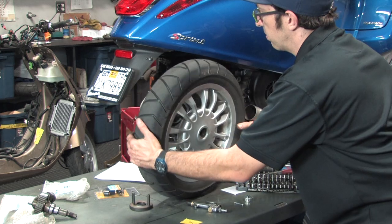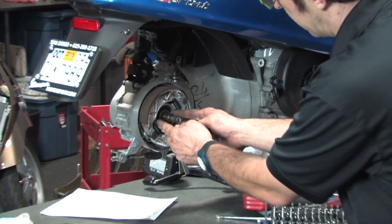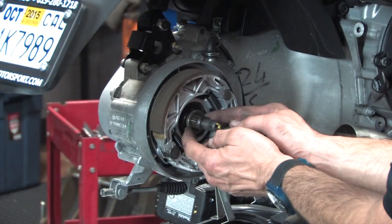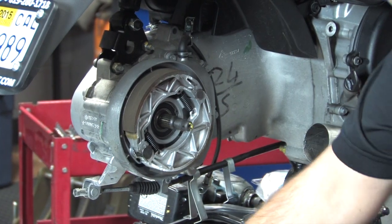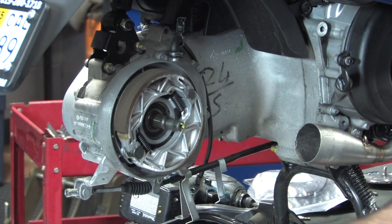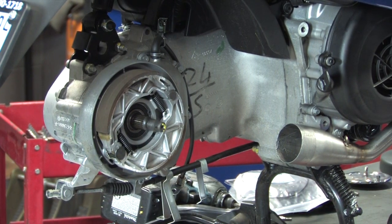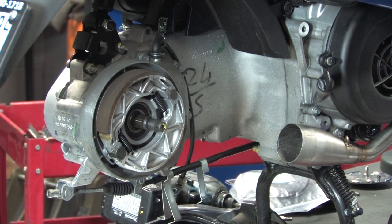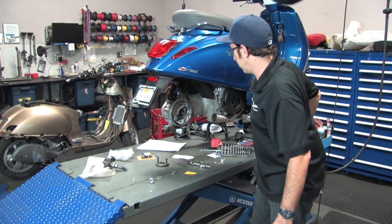There's your washer, wheel comes off. We've got another washer in here — a thick washer. Inside the hub is the thick washer; outside the hub is the larger diameter pin washer. We're going to have to disconnect the brakes and get the brakes out of the way. Some of the actual bolts that hold this final drive cover are underneath these brake shoes.